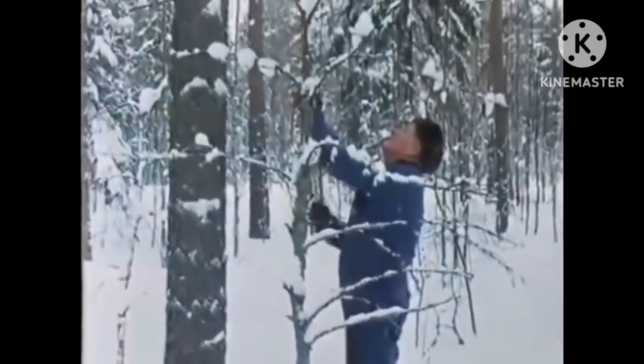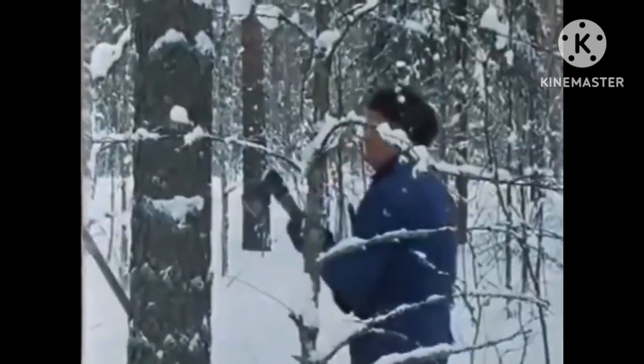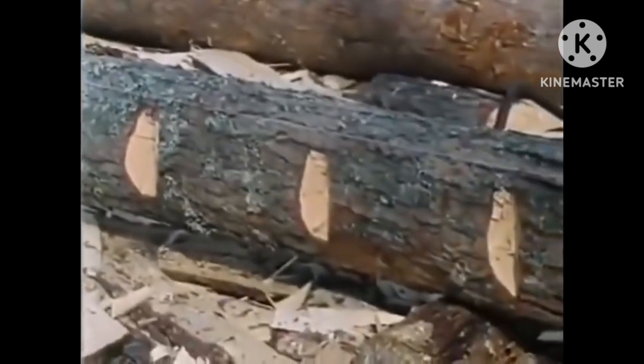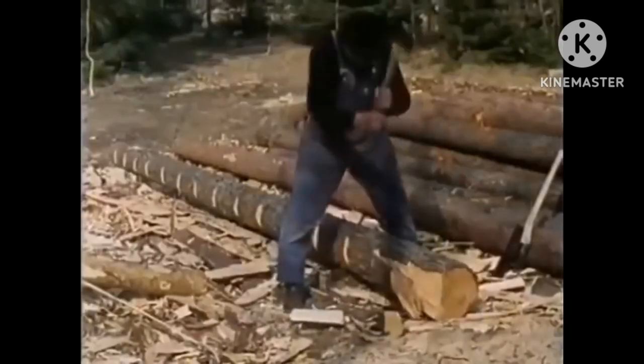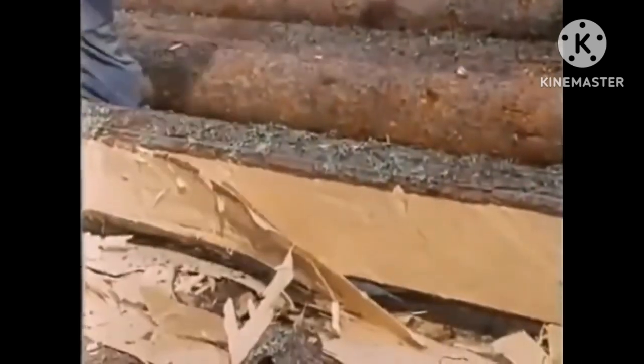Prior to starting the construction, the pioneers would have prepared the logs. Log buildings need straight pines with as few branches as possible. Traditionally, the trees were felled in winter when the trees were sleeping and the juice and moisture content is very low in them. They chopped perpendicular traverses with a normal axe and then cut the thick pieces up horizontally on each side. Then the leftover pieces were chopped with a broad axe.